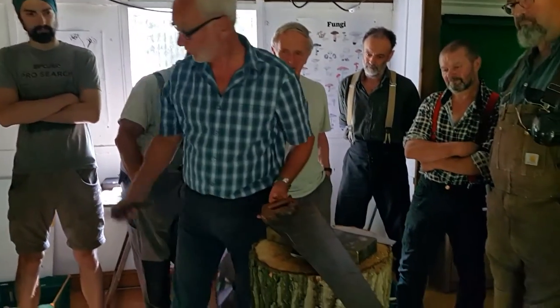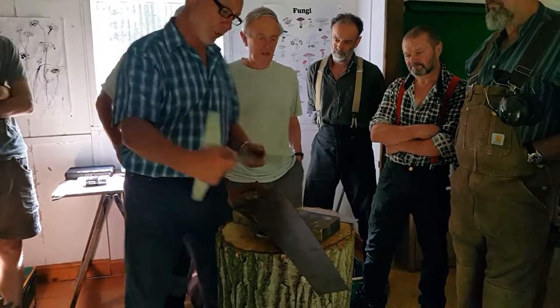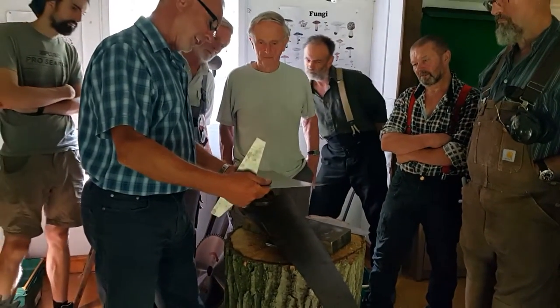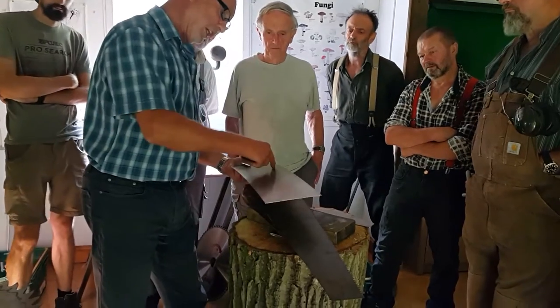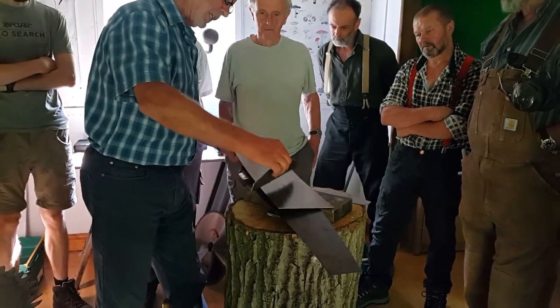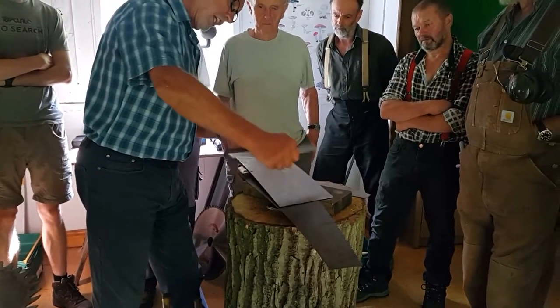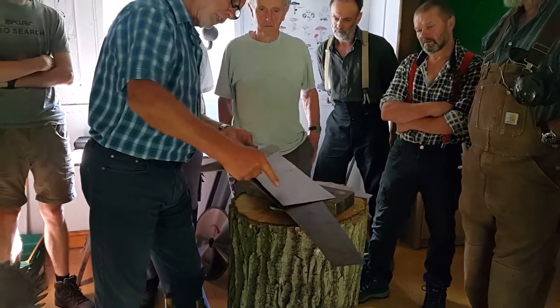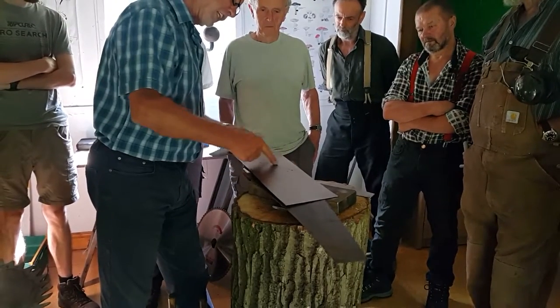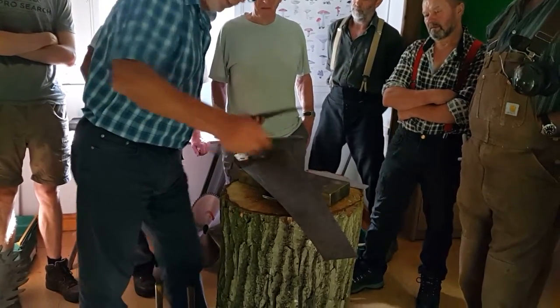Just roll like that piece of steel there — keep that piece of steel up here again. You see the hydraulic roll marks there? You see what effect that's had? What you do here is put some length — to get rid of all that tension that's been put in — I could smith down there with long shape marks to take that tension out. So we're going to have to stretch the edges a little bit.